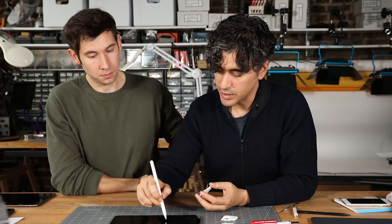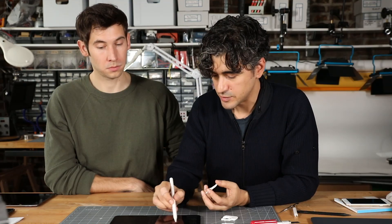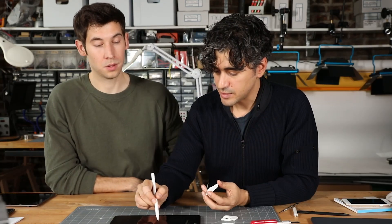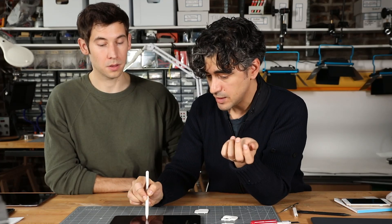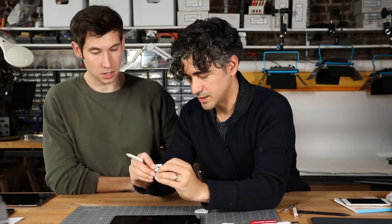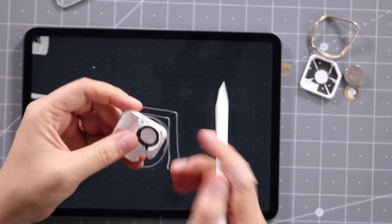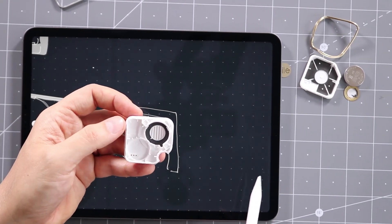The big drivers on the footprint: with the old battery, you could come around it and just have a wall — nothing else prevented you from doing that. In the new version, you've got the battery sitting here, and that foam gasket takes up space and needs a landing pad. Because the battery door has to slide on over this, you need a whole additional wall on the other side, plus all this space for the latching grooves. They tried to take advantage of the corner for one of the latches, which is nice — you have a circle inscribed inside a square, so that's smart — but still all of this other space is required, tons of extra material, and all this reinforcement to make sure it can latch.